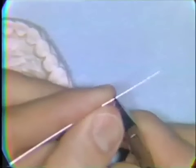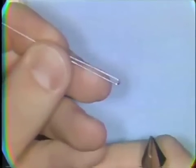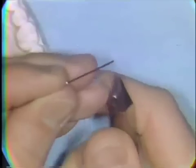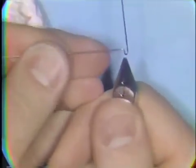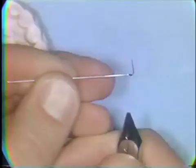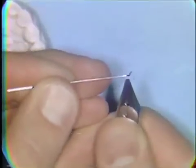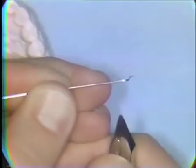A small loop is bent into a length of the 0.025 inch wire. The loop should be approximately one-and-a-half to two millimeters wide in outside dimension. The second bend is a 90-degree bend made in one side of the loop, to create a small extension of loop about two-and-a-half to three millimeters long. The bend is made so that the straight section is about 30 to 45 degrees to the flat plane of the loop itself.